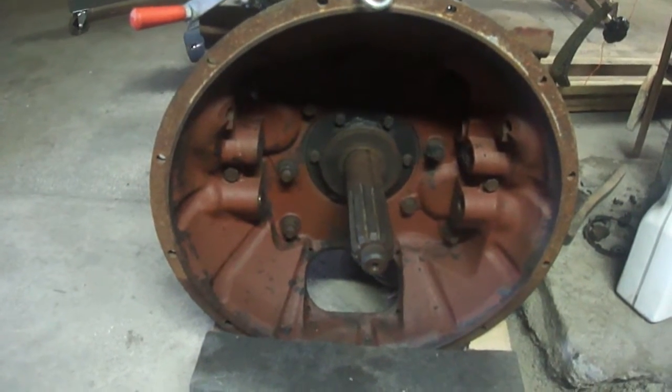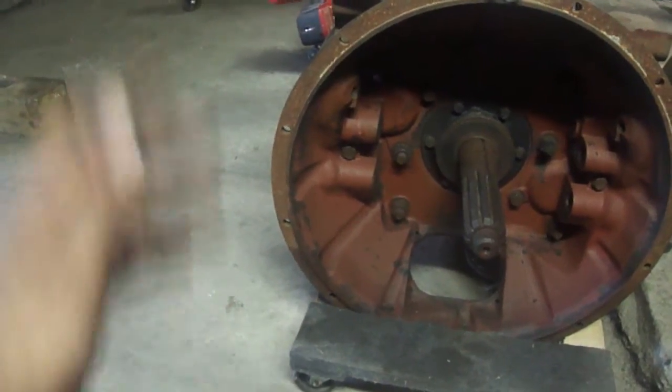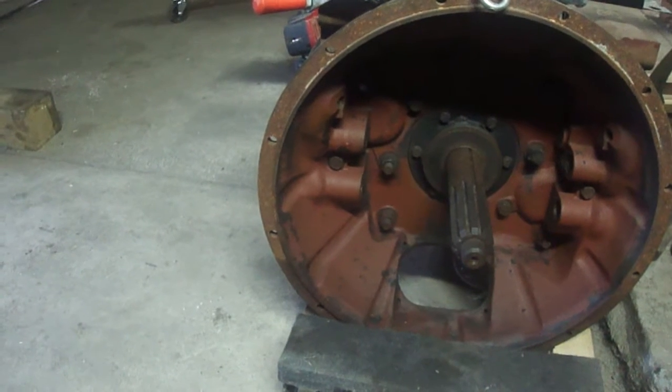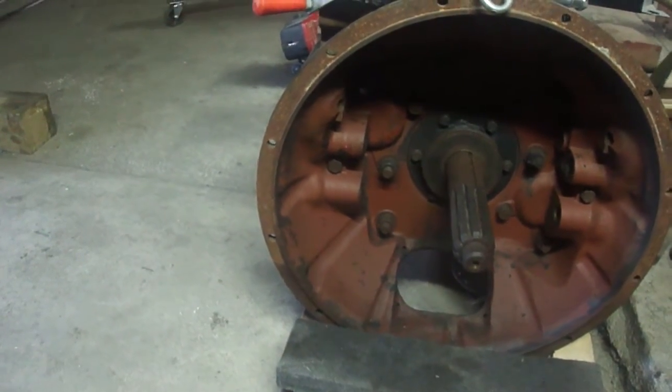The most common is SAE 1 — this unit is SAE 1. You can tell the difference by measuring across the diameter of the bell housing. Most bell housings aren't round; you have a clutch housing on the engine and a bell housing on the transmission, and that's where they meet together. SAE is just a generic standard used for these, and there are quite a few different variants.